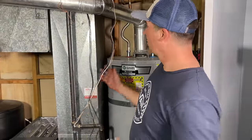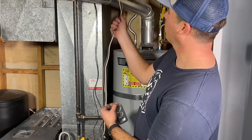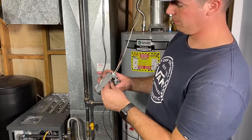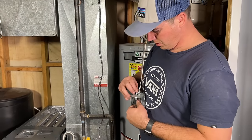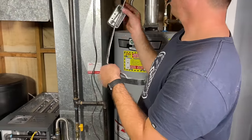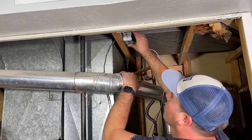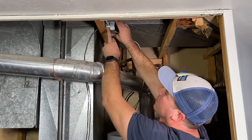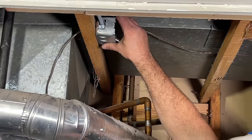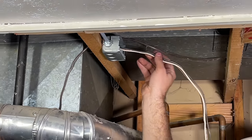Next we're going to start on our electrical. We pulled that old solid conduit out, so now we just have this bare wire up until where we still have it wrapped. We're going to feed this into our box using one of these little isolator fittings. Once we get this all the way through, our Romex shielding will be what's pinched there, keeping that wire from ever having any movement. We're going to mount this box here, clamp our Romex to where it won't have any movement or exposure to raw edges, and then have our quick-connect metal clad wiring run down here to our box.